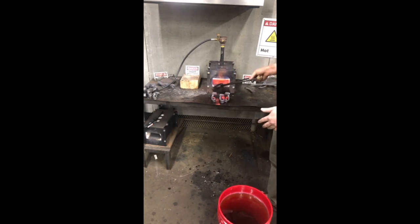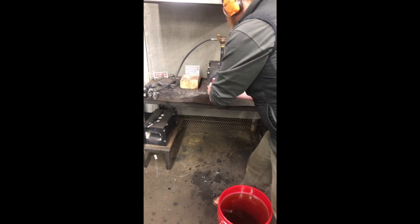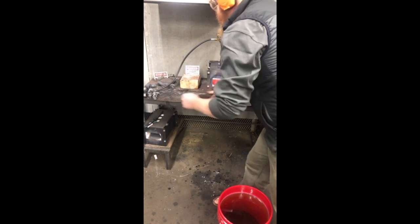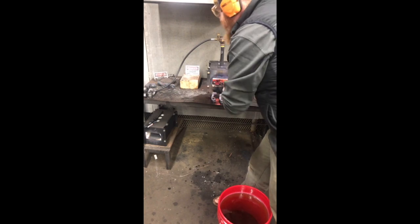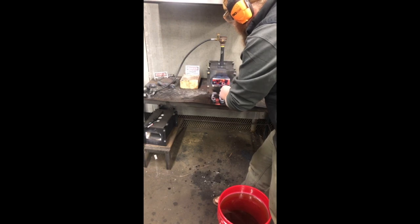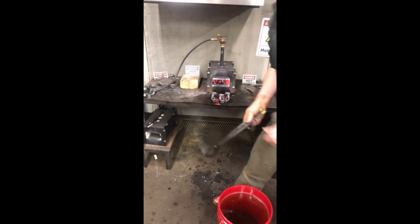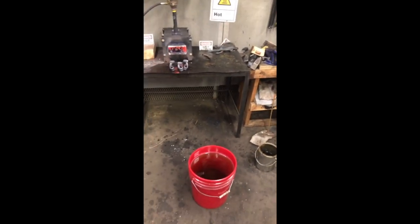I also want these to sit out here for a little bit to cool down - that's going to oxidize them further. I don't want to put these in the oil when they're too hot. I'm running the forge at a very low temperature, as low as I can, letting these warm up nice and slowly. I've got the area with the most thermal mass deepest in the forge so that it warms up the most.